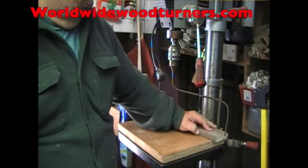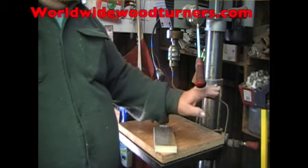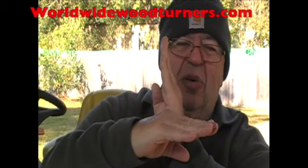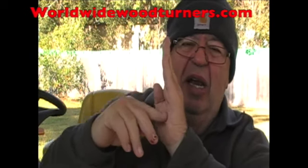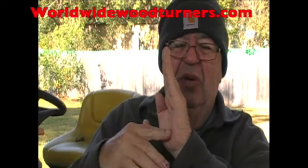Think about this for a minute. The drill press is coming down. If it's coming down like this, it doesn't matter. It's coming down, and you've got to have the other table perpendicular. So this has to be a true 90. There's no level, there's no plumb. True 90 in this profile. That's how you're checking with this gauge. It's a simple little project.